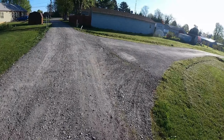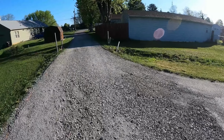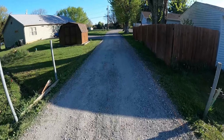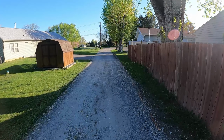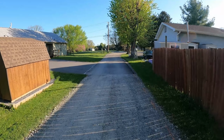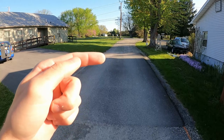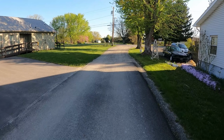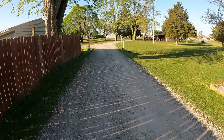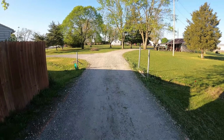And at this driveway here, we'll just taper it down so that way they don't have a big hump to drive over every time. That's it. It's just a straight up shot there to the road. There's a little asphalt piece here at the end of this driveway. We're going to be cutting off the millings here and just tying in with the asphalt, and then starting again and finishing it out to the road. So that's about it. Everything's already ready to go. We're just pretty much waiting on the millings now. So once I get here, then we'll get to it.